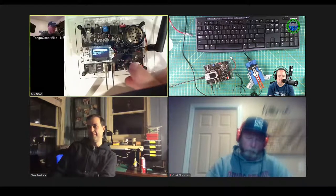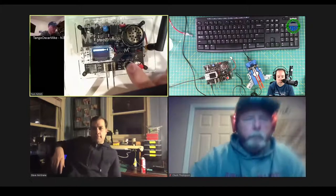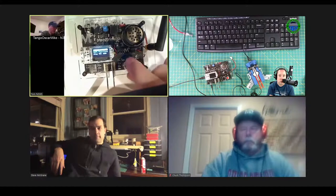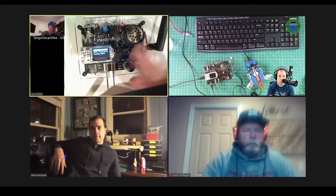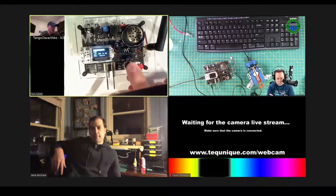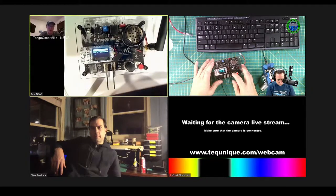Yeah, Wi-Fi functions. You go in and configure Wi-Fi, and that's what sets up the Morserino access point. You connect to it, and then you can check your Wi-Fi, and it'll tell you it's connected to my home internet, and gives me my IP address. And when you're doing it on the website, it's case sensitive, but it works really well.